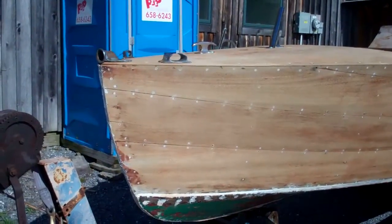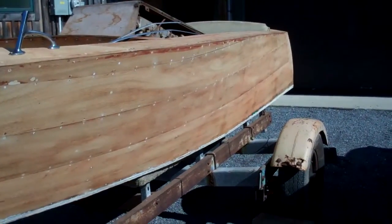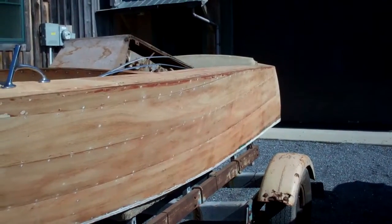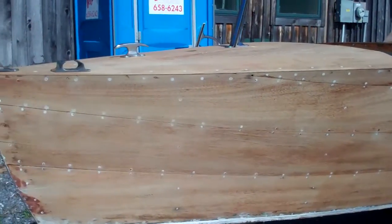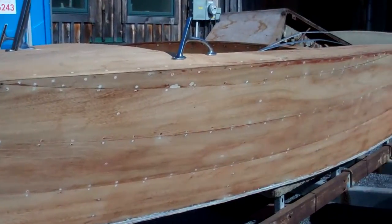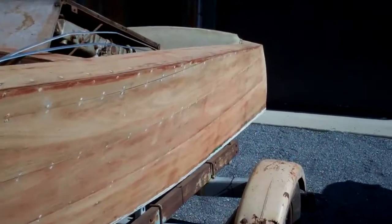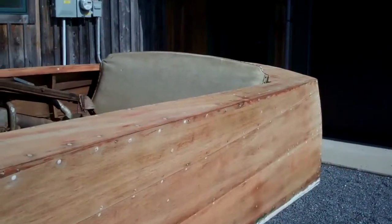The people who originally built this boat must have played hell getting those long, curved planks installed flat. All the screw heads right now — the countersinks are full of putty. We're thinking about cleaning out every one of those countersinks and putting mahogany bungs in them so that when we varnish the boat, it will look like a standard mahogany runabout.